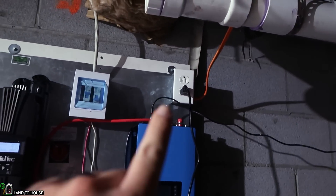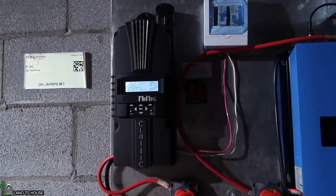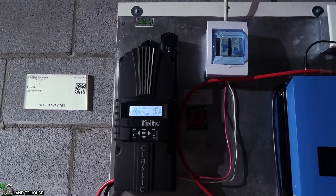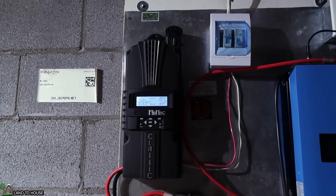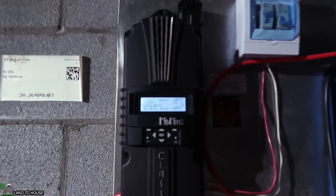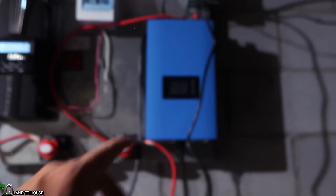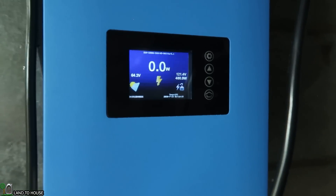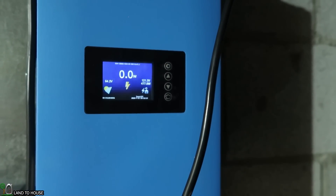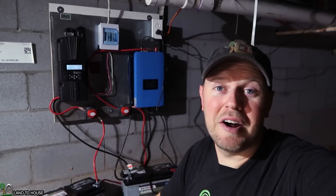There are five batteries total connected negative to positive so that it becomes a 60-volt battery bank in full. The wires go from the battery up to the inverter — red wire to this switch goes up, and black wire also goes up to the top there. A limiting circuit goes over to the main line into the house. I have a receptacle wired in right here, and the inverter has a power cable that comes down here and goes up into that. Currently we're making 78 watts — the input is low because the penstock is not full of water yet, but when it is we should be back up to about 170 watts. Batteries are at 64 volts. Once the batteries reach 72 volts, the inverter will kick on and it will start feeding power back to the house.